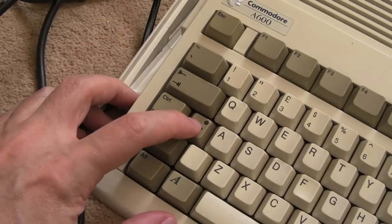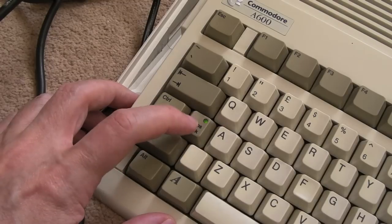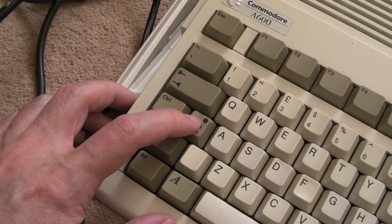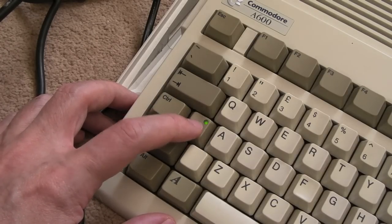That makes me wonder if the keyboard reset is the issue here, actually. Yeah, same exact behaviour. You can get the keyboard back by powering it off long enough, waiting for a red screen to come when you power it back on, and then following the red screen. If you just leave it on the red screen, it does what I believe is a kind of a watchdog. It's probably done by the CPU more than anything.